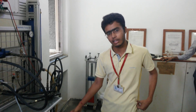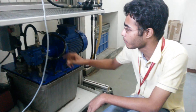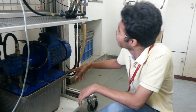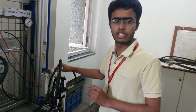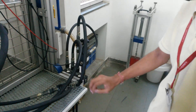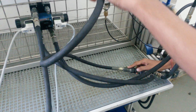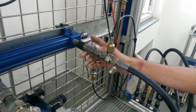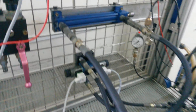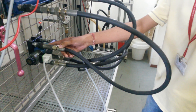Now we will start with the line connection diagram of the regenerative circuit. This is the pump and this is the reservoir. From here the pump transfers the hydraulic fluid through this line to the pump port, and here is the hydraulic pressure relief valve, which maintains the pressure limit in the system. From here the hydraulic line comes to the connector pin, and from the connector pin two lines go — this is the pump line connected to the forward stroke where extension takes place, and this is the line for the return stroke. Here it is connected to the 4x3 DCV in the closed center position.